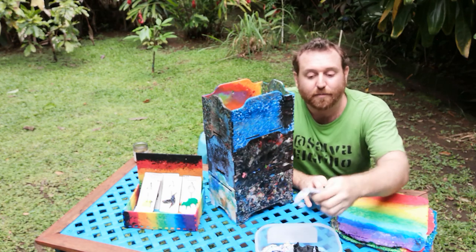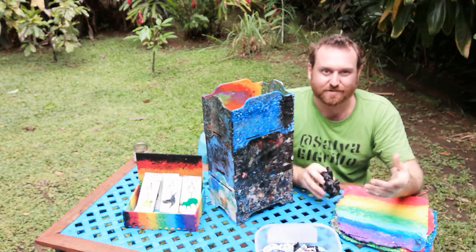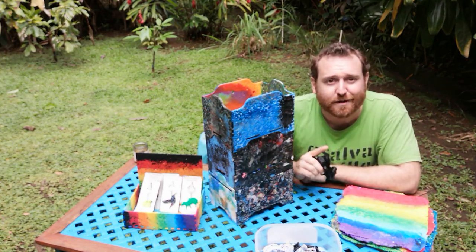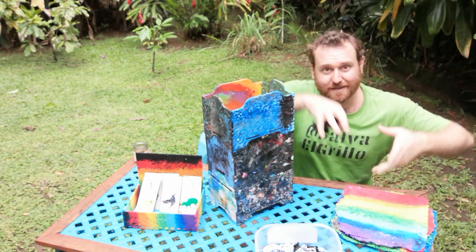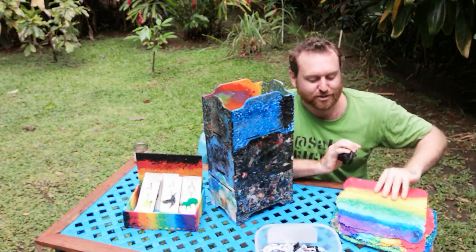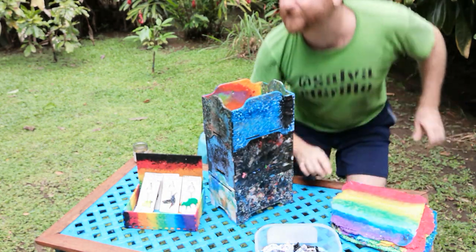This is important because not all plastics will stick to each other when you melt them — they have different melting temperatures. It's going to be a huge mess and you won't get good plastic performance if you mix your PLA and your HDPE together. Sorry, so many bugs — I've got to put on some bug spray.